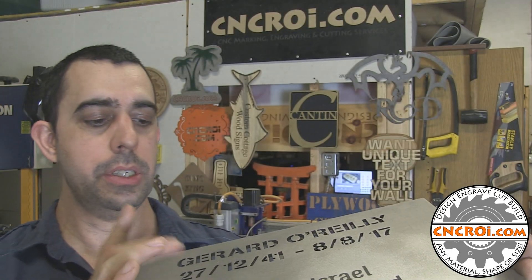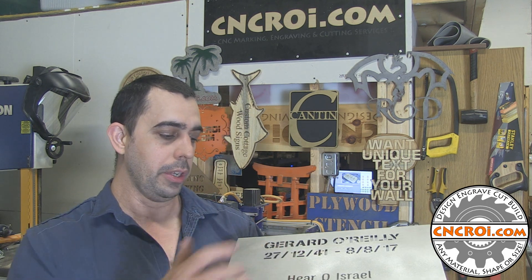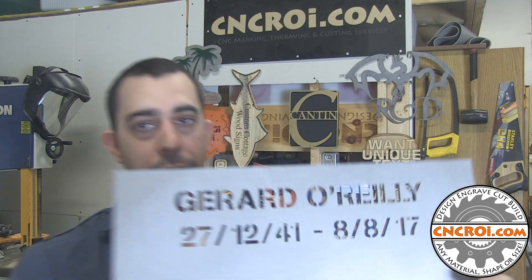The reason it was done with a fiber laser is because if we used Cermark or something like that — which we never use here in the shop — the marking would actually come off. By using a fiber laser, this marking is completely permanent because nothing was added or removed to the stainless steel plate. We cut through the top part for the same reason — we want something totally permanent that will probably outlast the last human on earth.